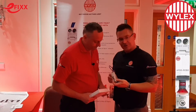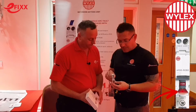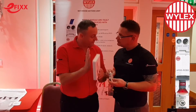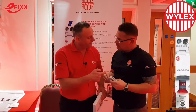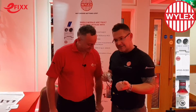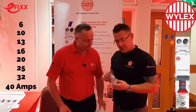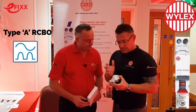At eFix, right at the cutting edge of the latest technology. Johnny's brought us the single module arc fault detection device — it's been out just over a week. It's got loads of features and benefits, including indication on the bottom to show which type of fault has been found. We've condensed all of that technology from a two-modular into one unit. Interestingly, they do make one in 13 amps. Available ratings are: 6A, 10A, 13A, 16A, 20A, 25A, 32A, and 40A. It's an MCB-sized type A RCBO.